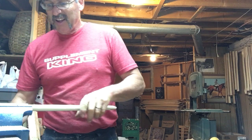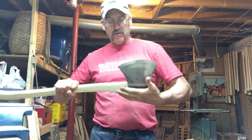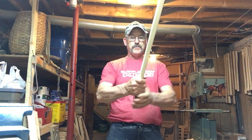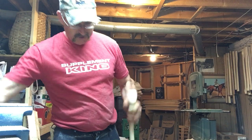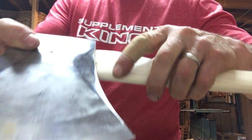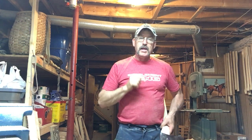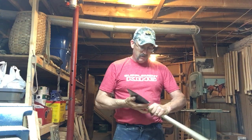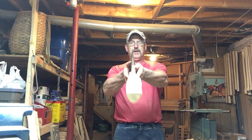Drift out, put the head on. It goes on three quarters of the way now — very smooth and easy. I'm going to tap it again to tighten it up. We've got about a half an inch to go. There's a curl here now — see that curl? You never want to leave that, because that curl means you've started to split in the wood. If you leave that curl and tap it on the rest of the way and just clean the curl off, you've started to split your handle. Check this out — it's perfectly in line with the handle. Right straight in line. Beautiful.